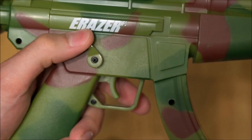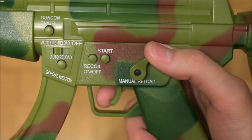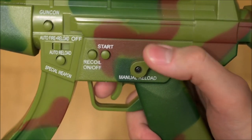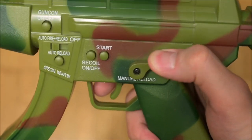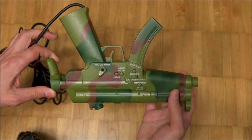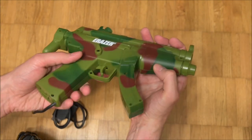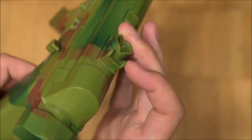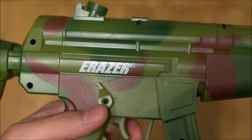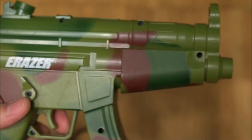At the top of the handle piece is an ambidextrous lever which is labeled 'manual reload'. It actuates a push button switch which briefly disconnects A and momentarily cuts off the light signal. Therefore, in Time Crisis-like games this button just works if going into cover is mapped to a normally open A. Similarly, in normal gun mode the manual reload button alone won't do the job, but if it is kept pressed, pulling the trigger will cause the gun to sense an off-screen shot event.